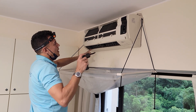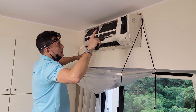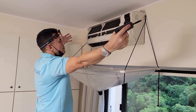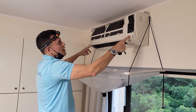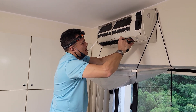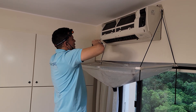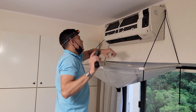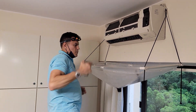So with these smaller models — basically one horsepower to one and a half horsepower, even up to two horsepower depending on the year of manufacture — there'll be screws hidden, just two screws underneath. The larger models, two and a half horsepower, or anything over two horsepower, will typically have one, two, three screws that are clearly visible once you open the casing. So very, very simple to dismantle — just remove that little cover there that's hiding where the screws would be. Really all you need to unblock the drainage from a Daikin AC is a screwdriver. It doesn't need to be cordless — any Phillips head screwdriver is fine. This one only has one screw in it because the other screw is missing and we'll put a screw there for you later.